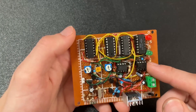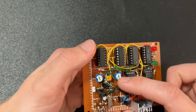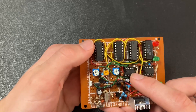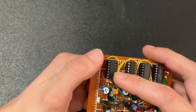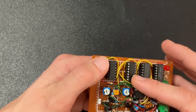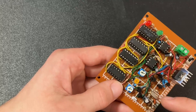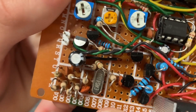This is the first 555 timer — it creates the clock signal that drives the Morse code generation. This 10k potentiometer, which is also fed by a fixed 10k resistor, controls the speed of the oscillation and in turn controls the speed of the Morse code. The second 555 timer is the audio frequency generator, and its frequency is controlled by that 1k potentiometer. This is a 74LS93 4-bit counter, which then gets fed through these three logic chips: a 74LS04 hex inverter, 74LS08 quad AND gate, and 74LS32 quad OR gate. Down here, this cluster of passive components and transistors is the transmitter itself, and the frequency powered by that crystal is 4 megahertz.